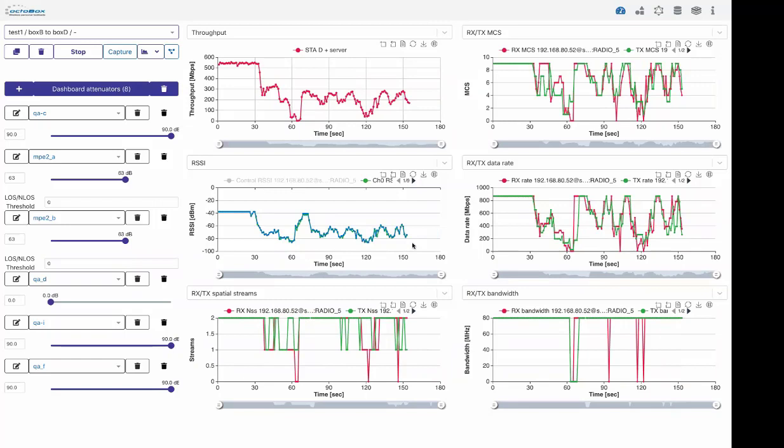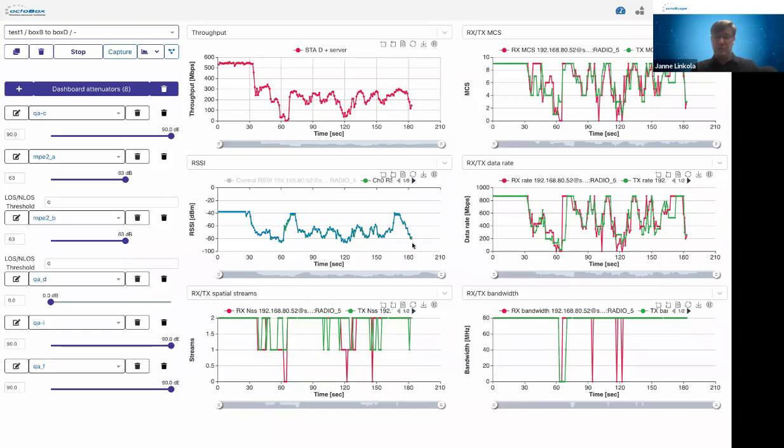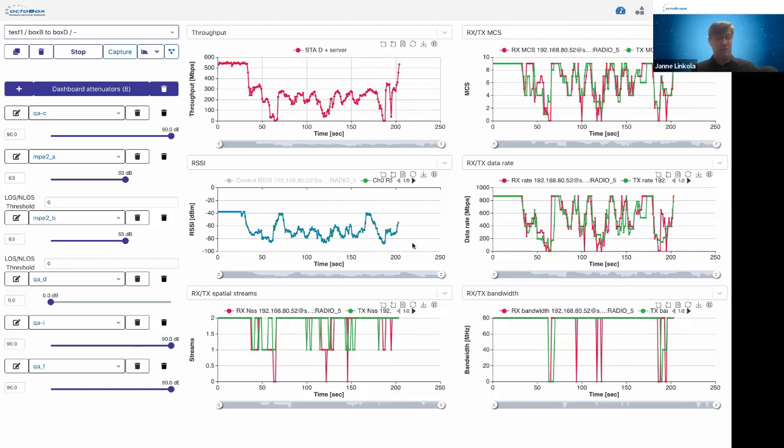I don't know, Naveen, if you want to raise your hand, we can unmute you and you can ask it. But I think the question is, will there be some sort of bias in terms of your measurement of the path losses based on the measuring instruments themselves? So we have basically calibrated that out, hopefully. We've taken into account the measurement instrument as well as the instruments emitting the signal, so that we end up with just the path loss being the thing that was measured.